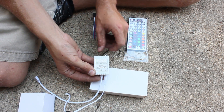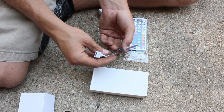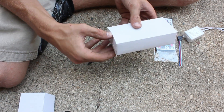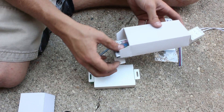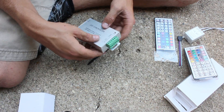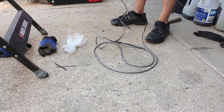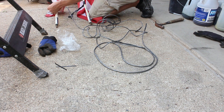The LED controller that comes with the strips is only rated for 6 amps, and that's what one strip draws — 6 amps. So it's only safe for one strip, but we're going to be using two strips since there are two poles. You'll want to buy a more heavy-duty controller that can handle more amps. The one I'm showing in the video is rated for 12 amps which is suitable, but the one I have mounted in my truck is rated for 36 amps and only costs about $12. I'll have the wiring diagram at the end of the video — it's pretty simple, it's labeled on the controller. I'm also reusing my old wiring from my previous LED flags for this build.